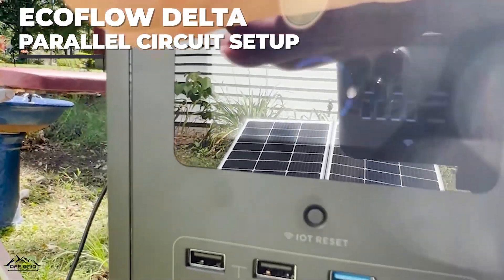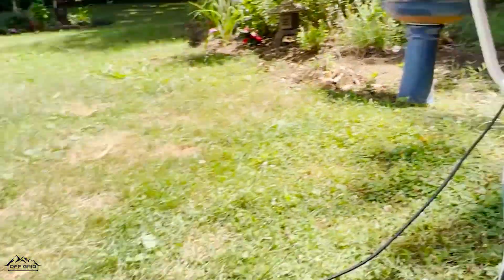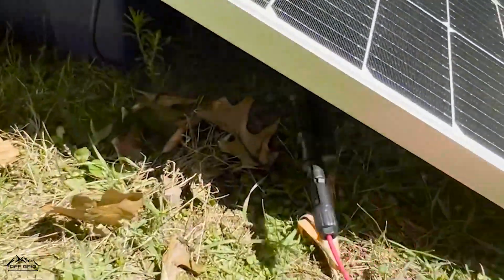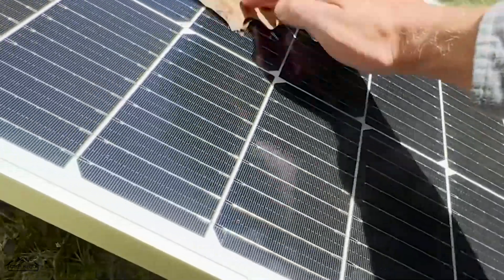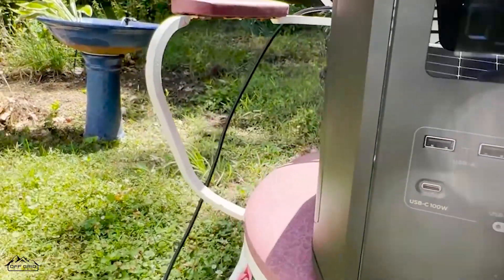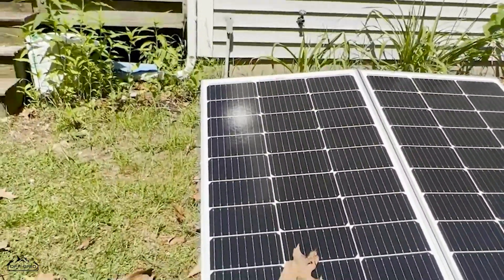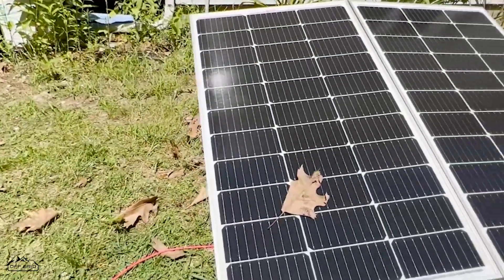Right away I've wired it in parallel and it's gone up to 167 watts — a little bit more than 80 out of each, could just be because the sun came out. The parallel connectors are back here, simple easy setup. So now we're just going to cover one panel. As we can see it's at 140 watts, and that's because in parallel it should only be affecting this one string — this string should be less affected. This obviously would make more sense if there were more panels in each string.